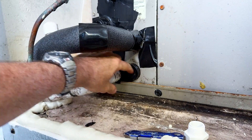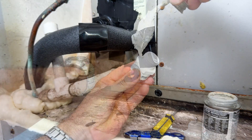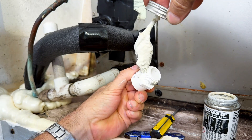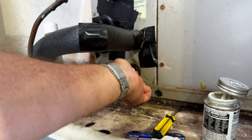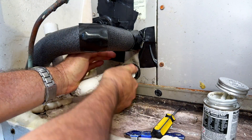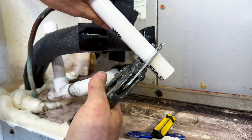If you don't have one, take a look — this will help you out. You should have another port down here where your drain is at. If you've got a plastic cover right there, just go ahead and pop that plug out of there. I'm going to use my three-quarter male adapter right here and add a little bit of thread sealant to that and go ahead and thread that on in there. You can use a pair of pliers to get that a little bit better than finger tight, but don't over-tighten it because it's plastic.